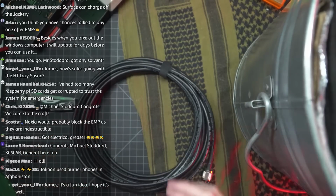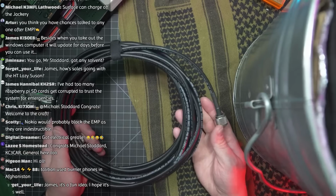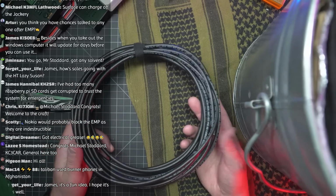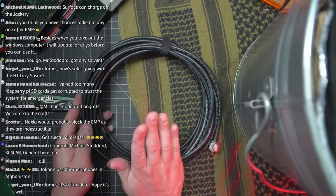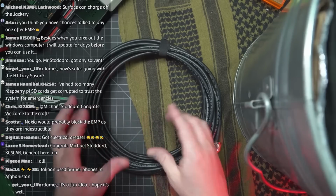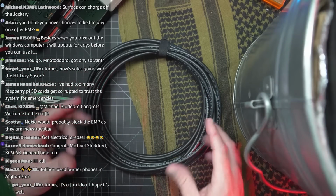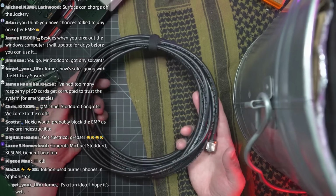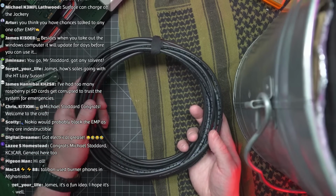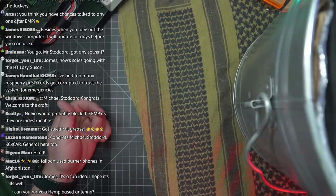All right, so I mentioned the coax. This is more here just to remind me to talk about the lid, which I've done. If you want to run a ham stick on this, you can, but we got done saying that near vertical incident skywave, where your RF comes straight up and comes back down, gives you about 400 to maybe 600 mile coverage. That's kind of what you want. You want to use NVIS, at least initially, if we were in a disaster type situation. So you may not need to use the vertical on this. You'll use another antenna, which is in the kit.